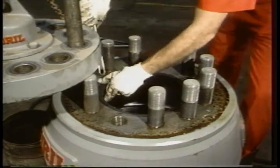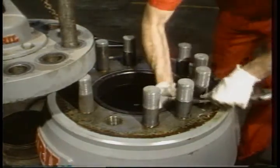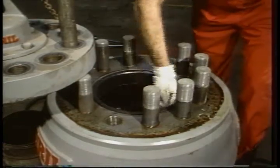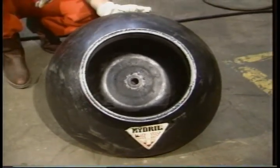If the seal between the head and body caused your leak, then make sure the diaphragm is seated properly and seals when the head is in place. You'll have to reassemble and pressurize the dampener with a small amount of pressure to check. Despite all the possibilities, the most likely source for a leak is a rupture in the diaphragm.